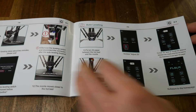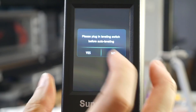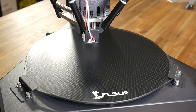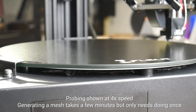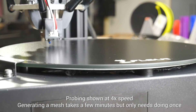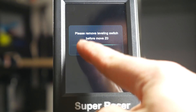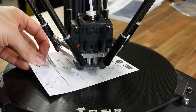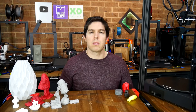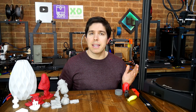After powering up the machine, we head to the instructions to guide us through the auto-leveling process. This machine uses a micro switch on a custom part that magnetically attaches near the hot end, and after we plug it in, we start the process from the LCD. The probing sequence is longer than a Cartesian printer — it did take a few minutes, but the system proved to be very reliable. Remember that the bed is fixed on this machine, so nothing went out of level the entire time I was using it, which meant this initial probe was enough to give me perfect first layers for all of my test prints. When the sequence is complete, we remove the sensor, use the LCD to move the print head down to zero, introduce a piece of paper between the nozzle and the bed, then use the LCD controls to move the nozzle down until the paper is just gripped, before saving the Z offset to complete the leveling process. The ABL system is actually one of the strengths of this printer, with pretty much perfect first layers after this initial one-time setup.